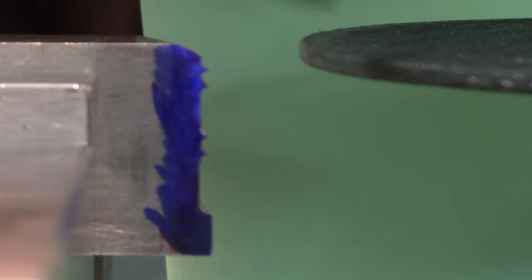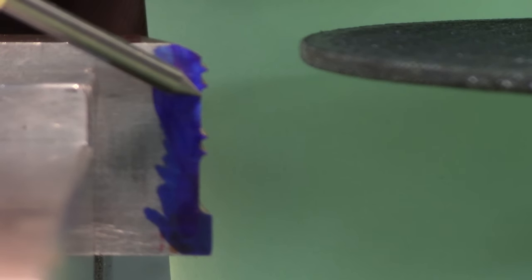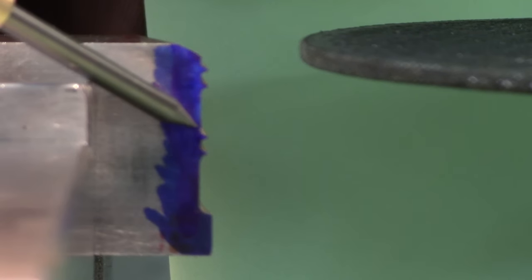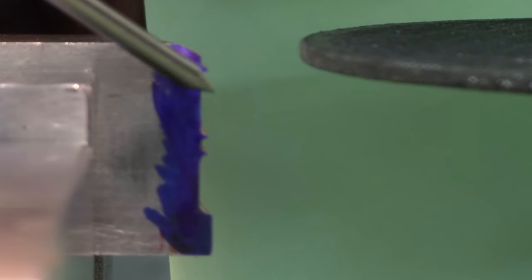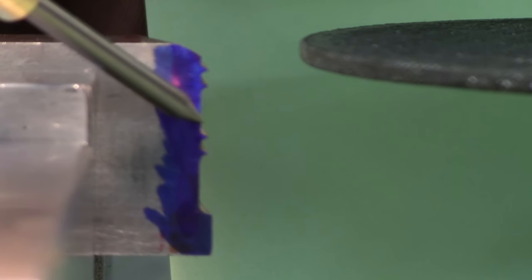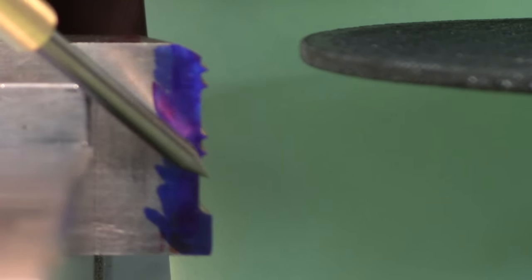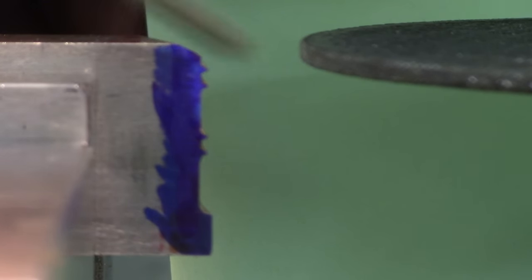I just came in, here's the grinding wheel. Now this is the thick one that's on here, but I just came in here with a thin one and ground between them and on the edges, and defined where the points were going to be with the small one and their depth. Then I put the big one on and removed the extra material here, here, and up here on the corner, because I needed some clearance here. So pretty simple how I did it.